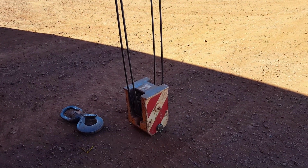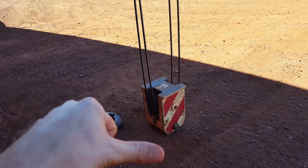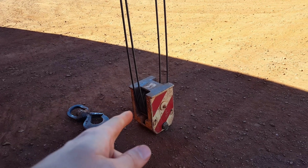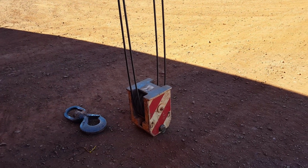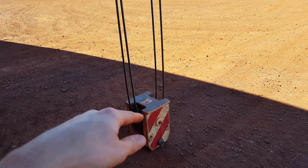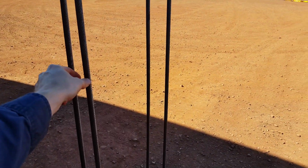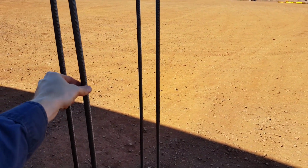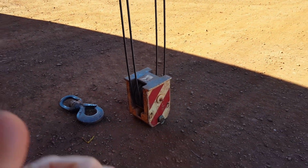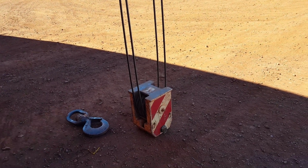When you place this hook on the ground to reeve it up, you boom it down onto the ground so the winch isn't moving. You don't use the winch to get it onto the ground. You always use the boom. Now if you winch the hook down and the weight comes off, you're going to be even worse off than 6 falls or heaps of falls in. It's going to be like there's 0 weight on that winch drum that we just had a look at. And so that's just going to bird's nest automatically.